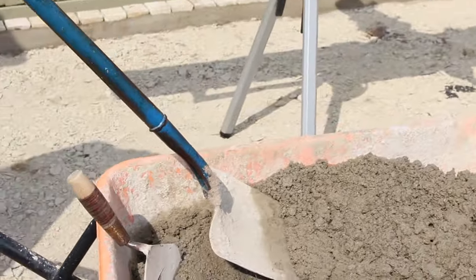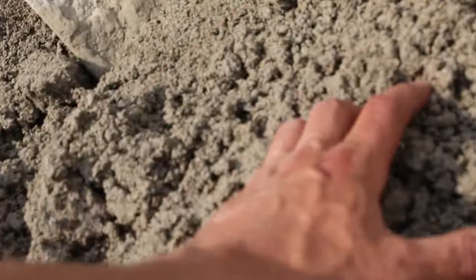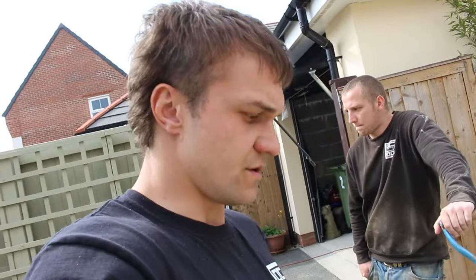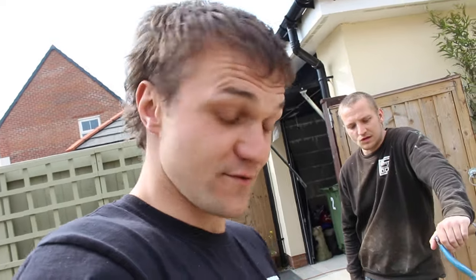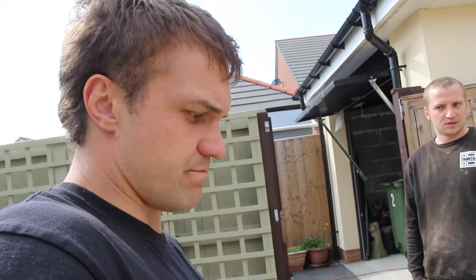We go for a bit of a semi-dry mix, so wet enough where it holds its shape, but still dry enough that when you're tapping in your cobbles, the previous ones aren't going to rise. So you want it malleable, but not too wet. I know it's pretty hard to understand just through the camera, but a bit of trial and error, you'll figure it out. You'll see what we mean. If it's too wet, you'll know really quickly. But anyway,